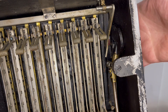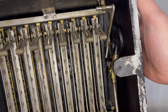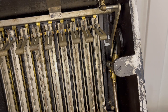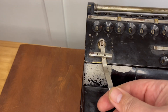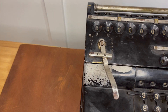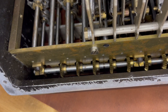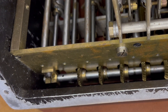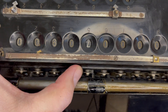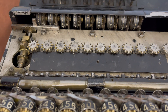Here's an internal view of that lever in action. This is the multiplication and division lever — you push it down and it also doubles as the carriage lift. This machine has a lot of troubles, including a missing bevel gear right there. That's also where the bell would be if it had one, though I'm not convinced it ever did. Some of the twiddler knobs have broken off, and it also has the carry gear tooth that meshes underneath with the carry down below.